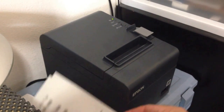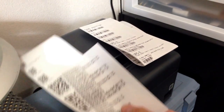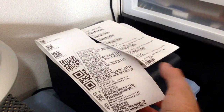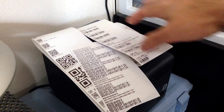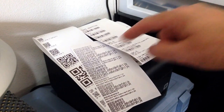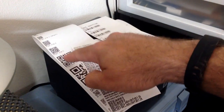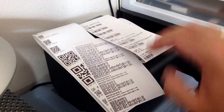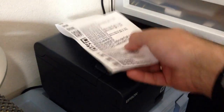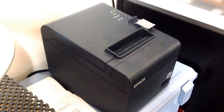This printer supports the ESC/POS commands that were written by Epson. Here are a couple of examples showing different fonts, barcodes, and barcode symbologies. All I'm doing is sending a certain bit of text and the printer actually converts that to the specific barcode or specific font size. That's one way to send content to this printer — you have these ESC/POS commands in a line data file and then you just command-line it over to the printer.